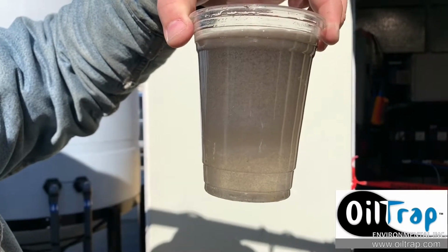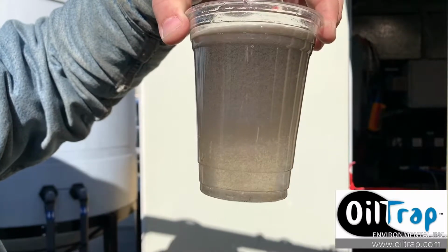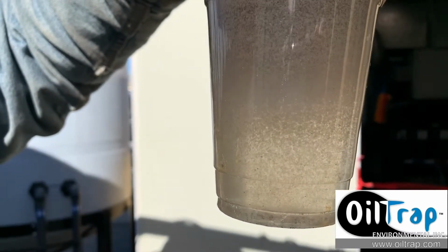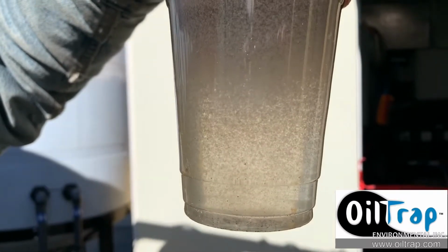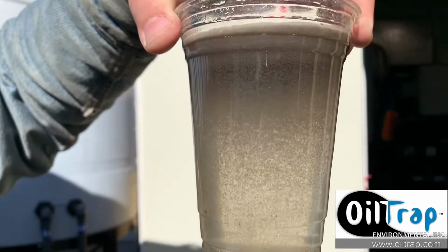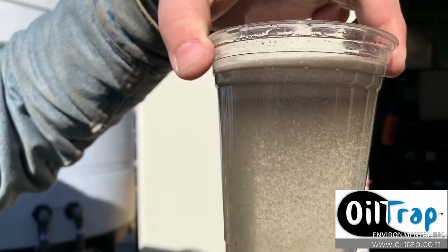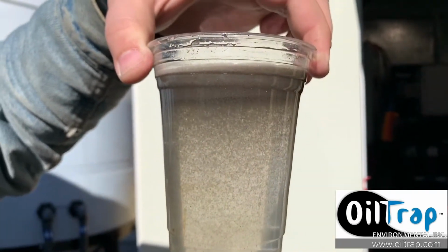Inside the separator, this same action is occurring. The clear water from the bottom is moved to the next tank for added separation time, while the solids that are forming at the top of the separator are swept off and deposited in a sludge dewater vessel. This is a continuous process that can occur 24/7 and requires only one pump to push the water through the cells where gravity manages the remainder of the process. Let's set this sample aside for now and take a look at the separator.